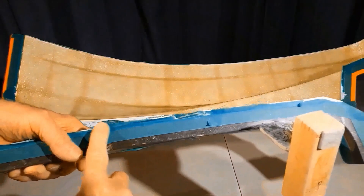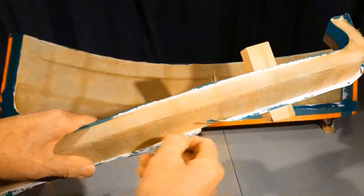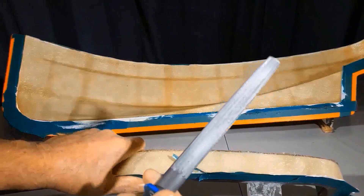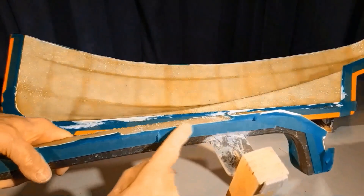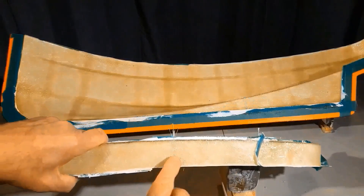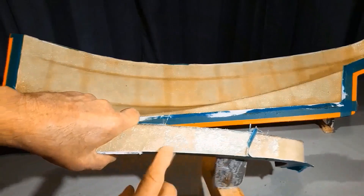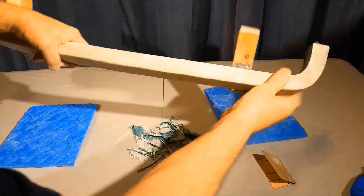The molds all have a masking tape boundary for the resin around the perimeter. The resin and gel coat has built up a little bit on the inside of the tape, but that buildup is still quite thin and the tape is bendable. So I'm going to use a file and just run the file. Applying the tape has made a very accurate surface for the overall outline of the layup, and by just filing like this we've got a pretty well perfect part with almost no mess or cleanup. It's fairly straightforward to file this edge all the way around the flange mold.